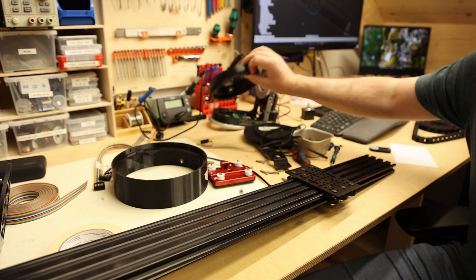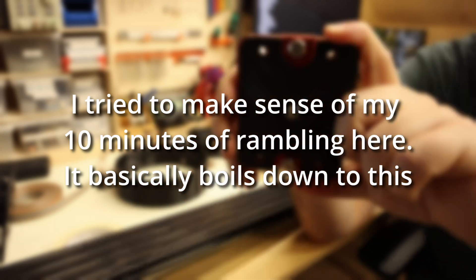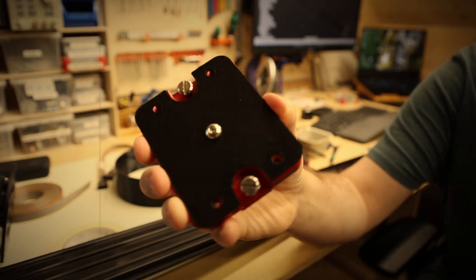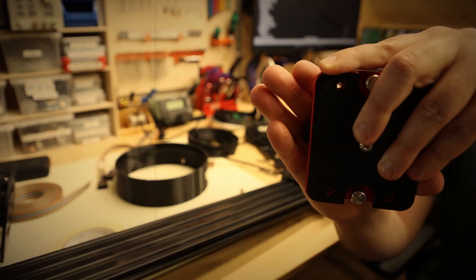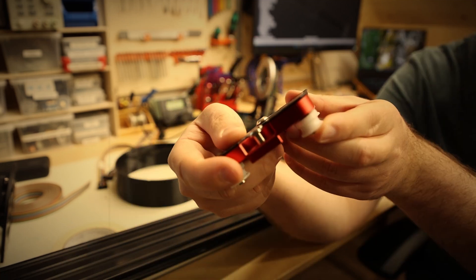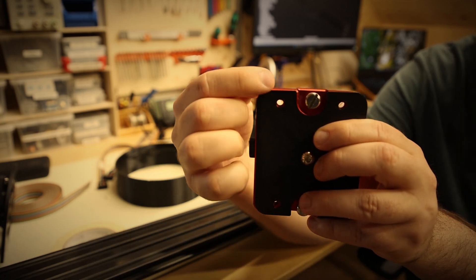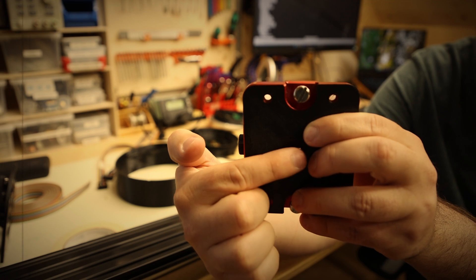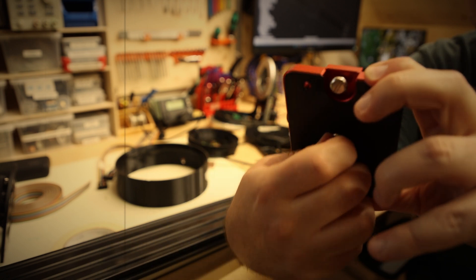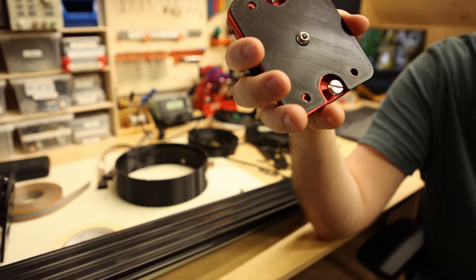So the problem I found here — four holes, not symmetric. On the test piece the center hole is in the middle, that's okay. You can see a little bit of red on one side, but on the other side no red — this edge is sticking out. I checked the measurements against the borders: this hole to this border, this hole to the upper border. I did all four holes the same, symmetric to the center hole. But they are not symmetric on the original aluminum part. That was just the nail in the coffin for the sliders.